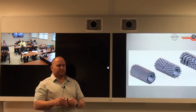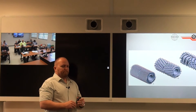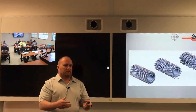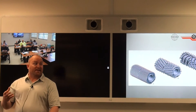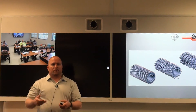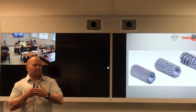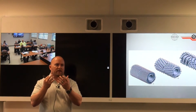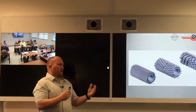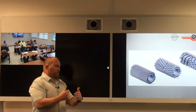Here's my philosophy with feet per minute. If we're doing full depth removal — just going to dirt or stone — and it's really easy material, like some parts of the southeast where it's very low aggregate, a lot of sand, we just call it black sand — if we're not putting any kind of load on the machine, go as fast as you want. But understand the limitations of the machine and how the material is going to act when you cut it up. Because we may get underneath that material, get a massive chunk, it gets wedged on a conveyor belt, and we've damaged some machines.